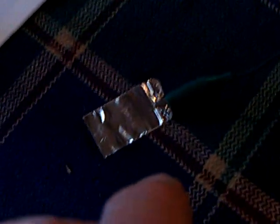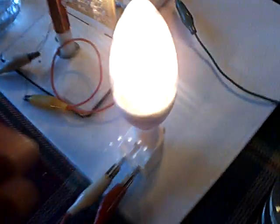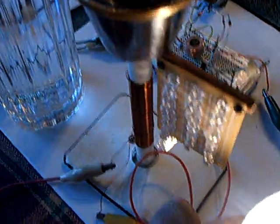That's just stuck in that glass of water there, electrolyzing. You notice there's no tower here. I'm using this water glass as the tower for the exciter, and it's not attached to anything — just a piece of aluminum down there on a clip lead. I just set this glass of water on it and it's making everything work. The bright LEDs are gone, plus I've got electrolysis going on in there, which indicates current, and that's why that's an important experiment.